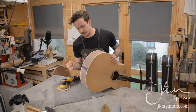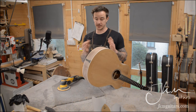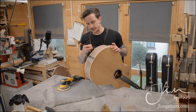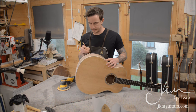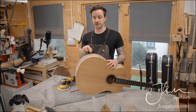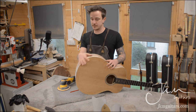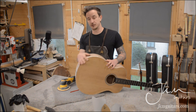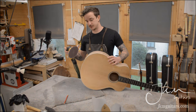The ribs are coming out quite smoothly — I flattened them quite thoroughly before applying the binding so there's not a whole lot of work to do here. I can see little areas where pencil marks are still visible. Again, don't attack those areas directly because those are the low spots — you need to attack everything around them. Keep the pressure light, keep it moving very fast, don't spend too long on any one area, and you should find these go away in just a few more passes.